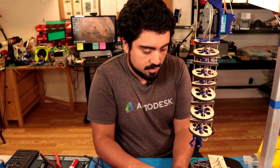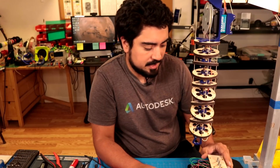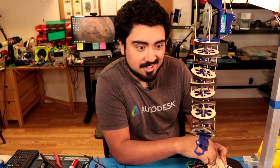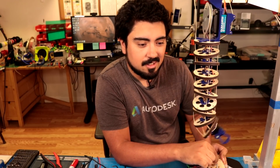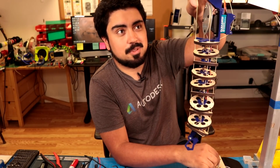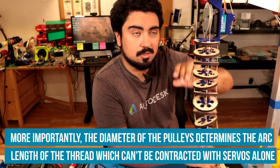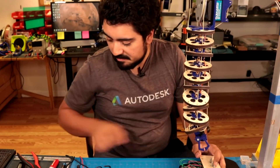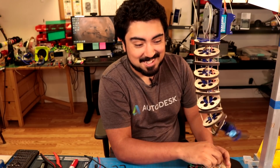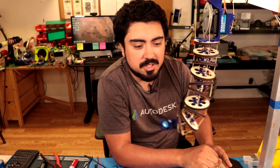I've got my 5-volt power supply here — let's just plug that in. By default it'll be in the neutral position, and I've got my three potentiometers for each of the axes. Let's try the pulleys. Let's try the other one. There we go. You'll notice that it doesn't curl very much, and that's because the pulleys can only rotate 90 degrees in either direction. If I wanted a much tighter arm, I would need motors — probably some stepper motors — that could spool up quite a bit more. But let's give it a tool and let it hold on to that. That's very satisfying. I don't think it's going to be helping me around the shop like Tony Stark, but it's close, a little bit.